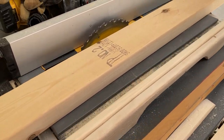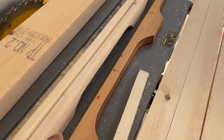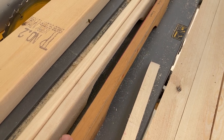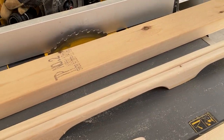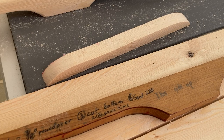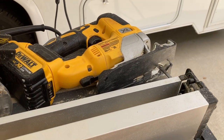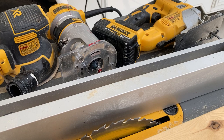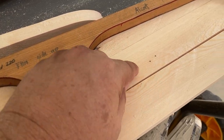For tools, we use the table saw to cut the piece of wood to the height, and if it's not already 1x dimensional lumber we can rip it to get the width. Then we trace out the pattern on the wood, cut the end pieces off, and use the jigsaw to cut those. Next, we route the top using this router with a 1-1/8 inch router bit.